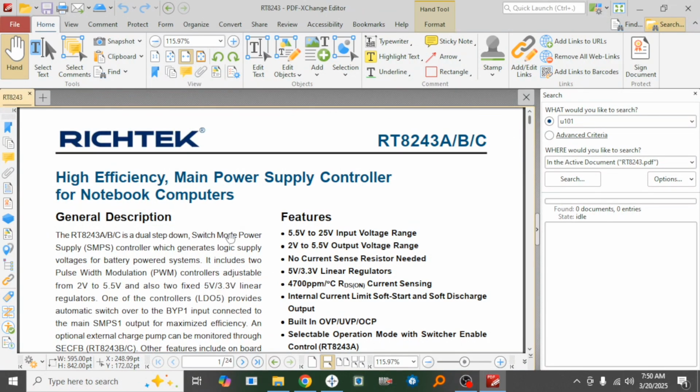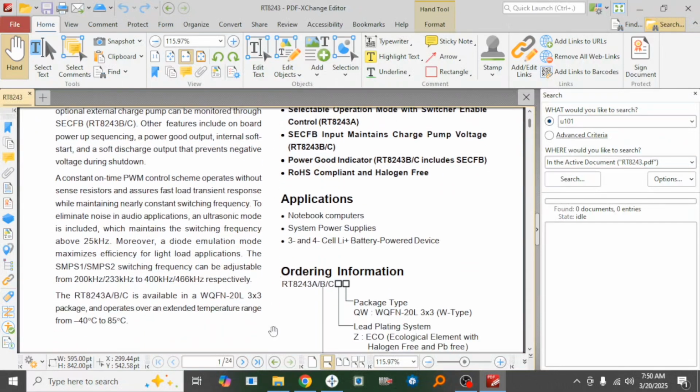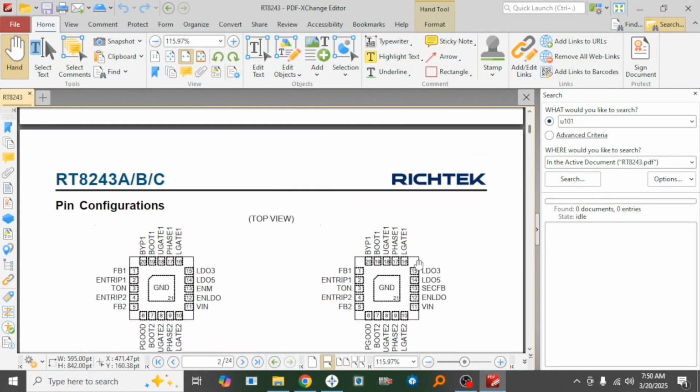Normally, the 3.3 volt linear section is normally shorted, as I said before. If it is shorted, normally the RTC section is shorted, right? Which is most likely a dead PCH or a dead CPU, or the embedded controller, which we call the EC, or the IO controller. I normally call it the embedded controller because it has a firmware inside, right? Or it reads a program in order to configure the GPIO pins.